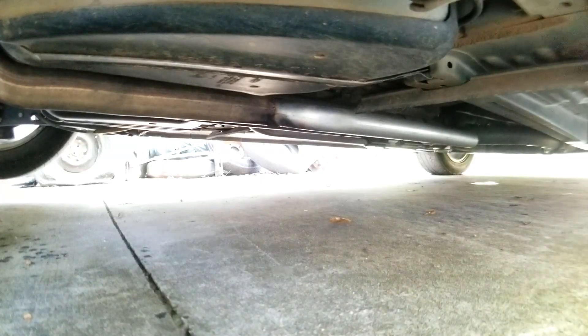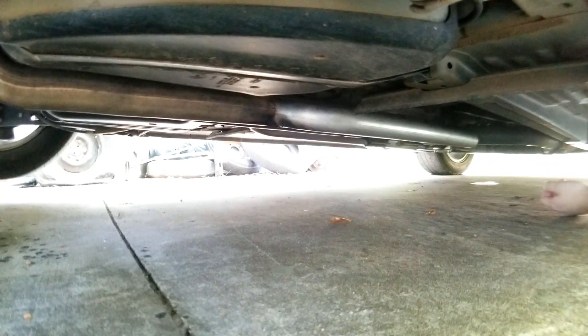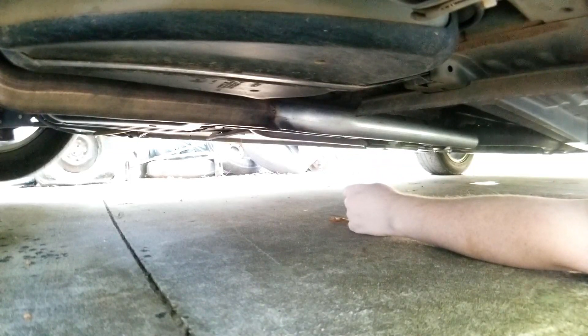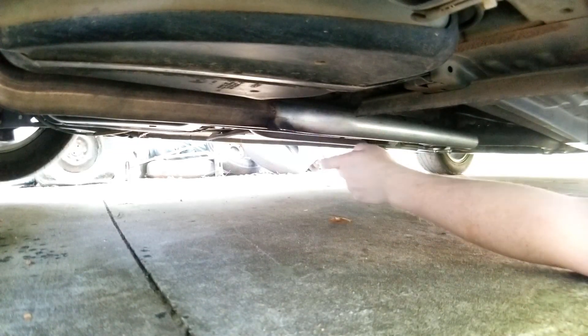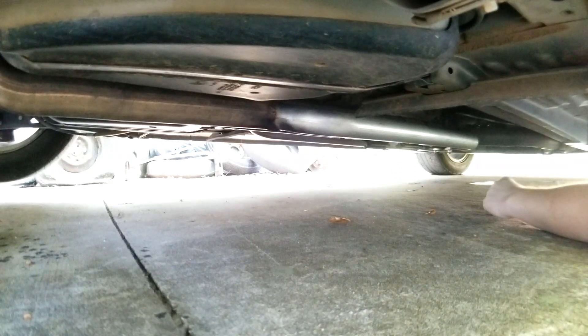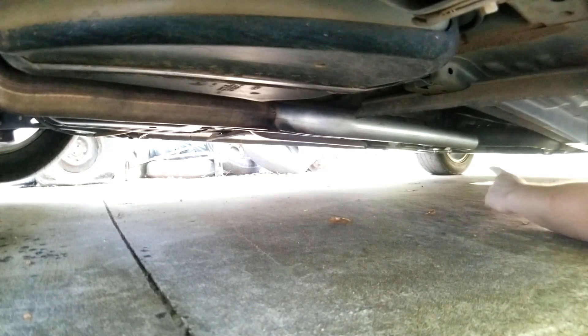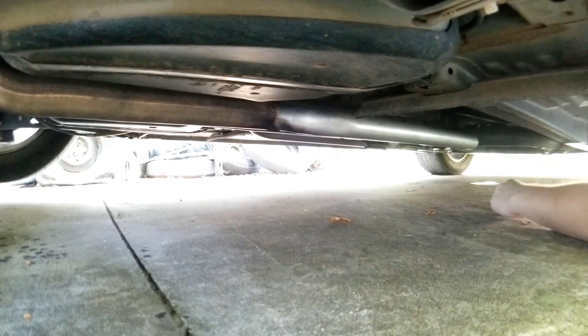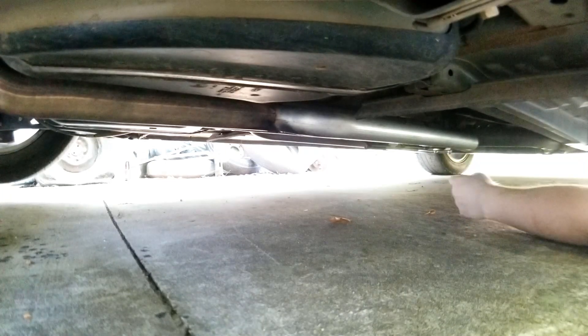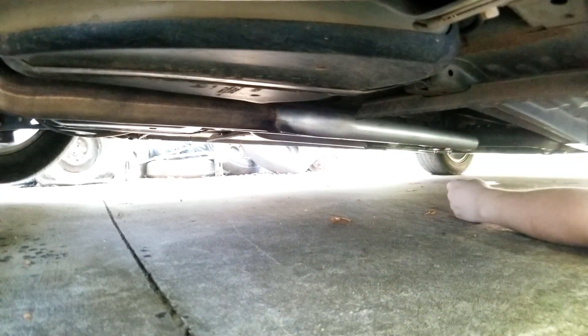It's pretty simple. All you're going to need is a hole saw, your piece of pipe, and a welder. Pretty much all you do is drill a 2-inch hole, cut the pipe, and weld it on. What I did was use a 2-inch hole saw, cut out a little circle from a piece of sheet metal, welded it back up, and that's my cap. As you can see, there's not much to it — it fits under the car nicely and runs right alongside the existing pipe.